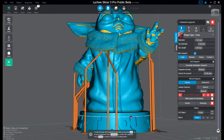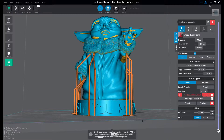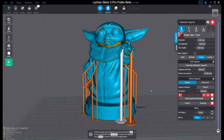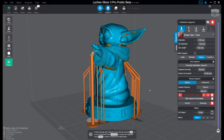The problem is that when you work with supports on a resin printer, when you think you have enough supports, it's just halfway there usually. I like to add heavy supports for long parts, like this hand, because they are going to grow tall. Light and medium supports get a little bit fragile within those distances.